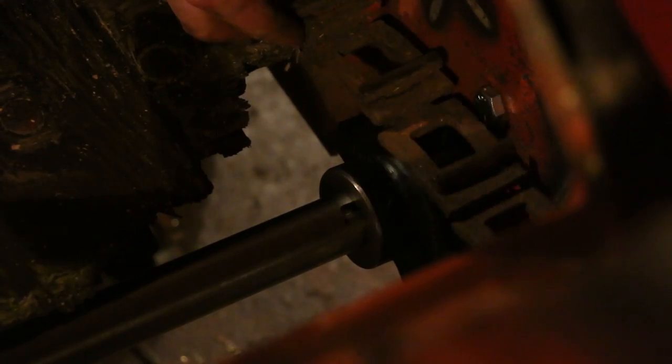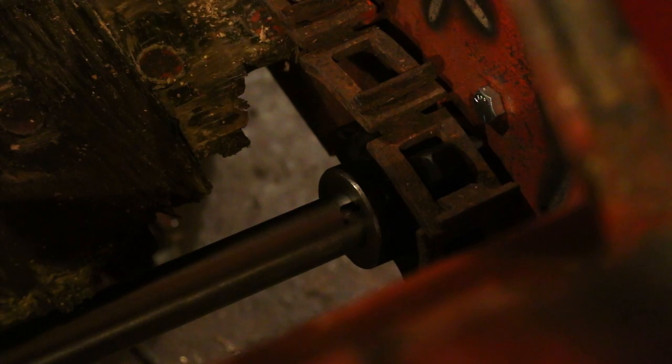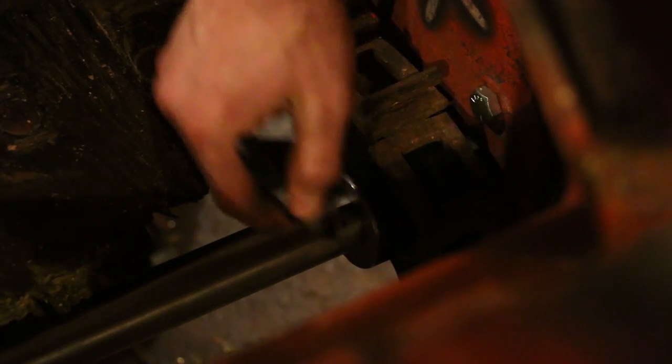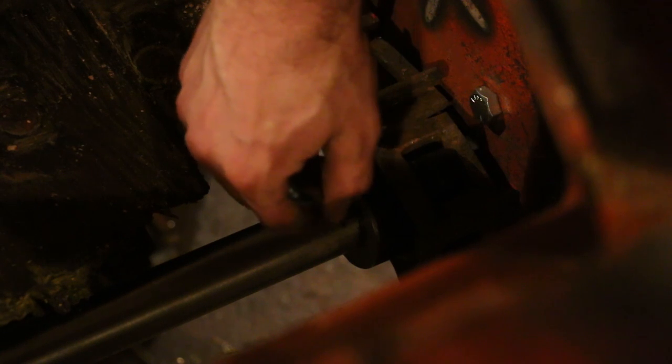The chain has slats going between every 10th link or so, and so it's really important to get the sprockets spaced right. So I laid one of the slats between the sprockets, and then I could center them that distance apart in the bed.